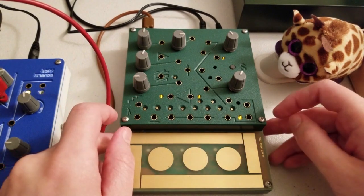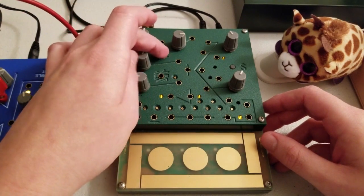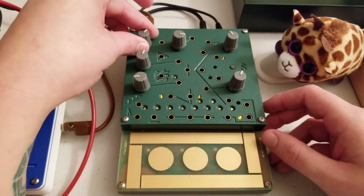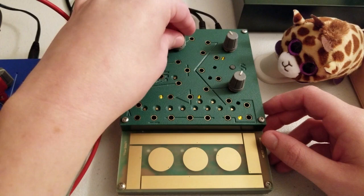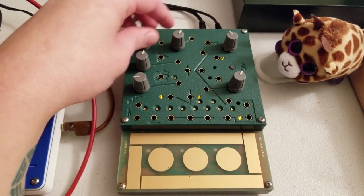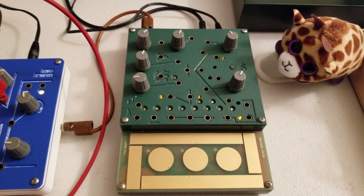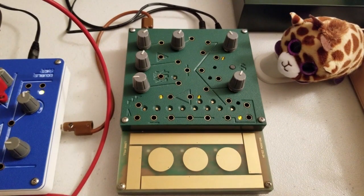Anyways, so what is the signal flow of the Mosstone? Like I said, it's very minimal. It's a triangle oscillator. You have a triangle output here. That's just the raw triangle. And that triangle oscillator is tuned with this bass tuning knob. Now, this is the only knob that doesn't do double duty. Every other knob does the double duty thing where it becomes an attenuator if you plug something into it. This one is just going to be a volt per octave pitch. There's also a volt per octave and gate on the back, by the way, if you aren't interested in the whole key thing, though I think that kind of defeats the spirit of the whole instrument. Though, interestingly, you can also plug in a melody into the volt per octave in the back and have these work as offsets, which can be fun.